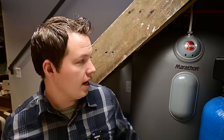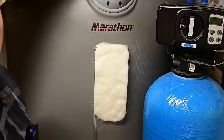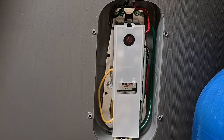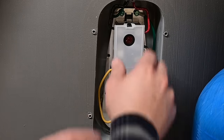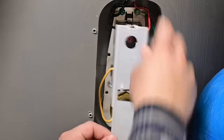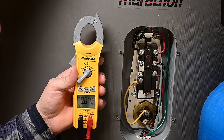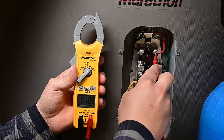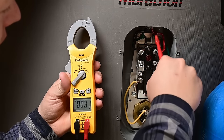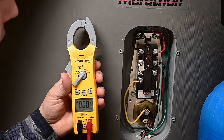I have the power turned off to the water heater now. We'll remove the top cover as well as the lower cover. We're still going to treat this as if it were live until we actually get our electrical tester and ensure there is no power. We'll pop off the plastic cover — it just comes off like that — and you can see we have lots of exposed terminals, which is why we have to be so careful. We'll put our tester in volts alternating current mode. There is no power coming into the water heater — verifying from each leg to ground we have virtually zero volts — so we are clear to continue the troubleshooting process.